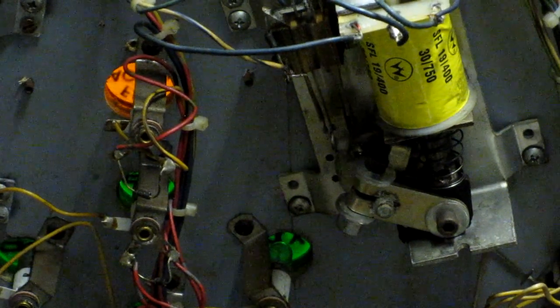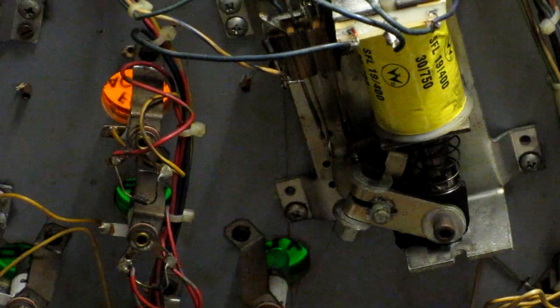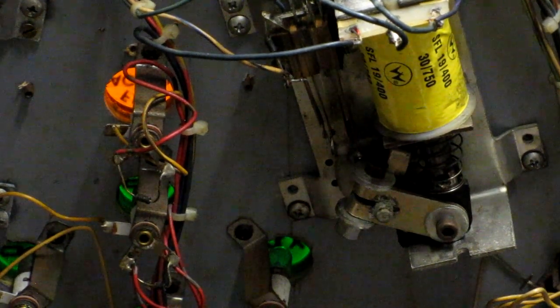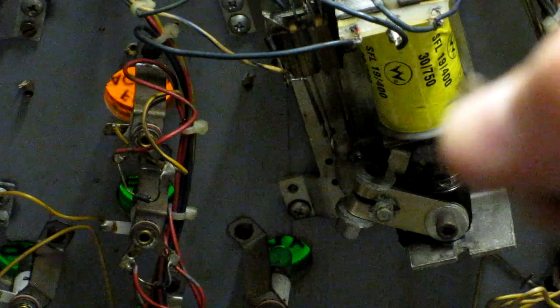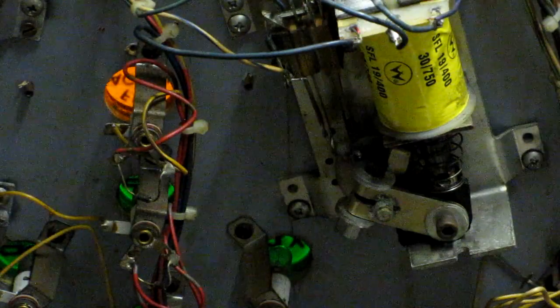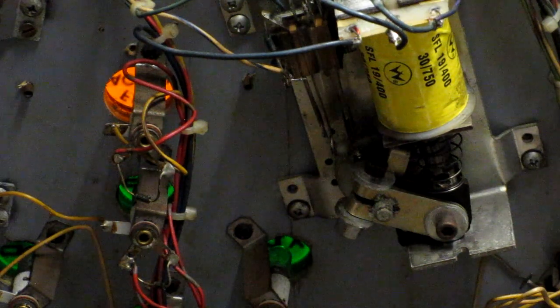I've just gone and removed a switch from one of the other spare playfields. So if we have a look, that doesn't focus very well. That's this switch here. Now the EOS switch is really worn out, but the lane change bit looks okay. So I'm just going to separate the switch stack and fit just the lane change switch to my playfield. Let's try that now.